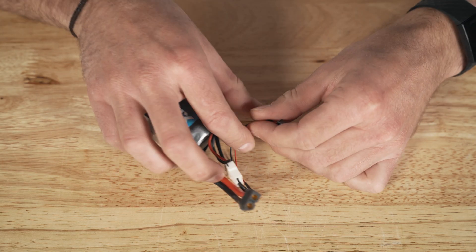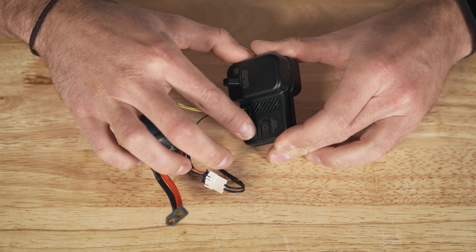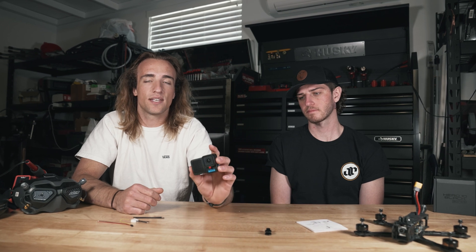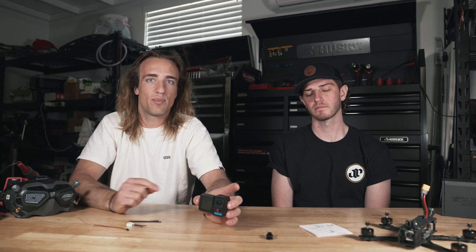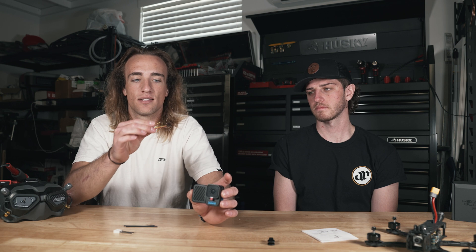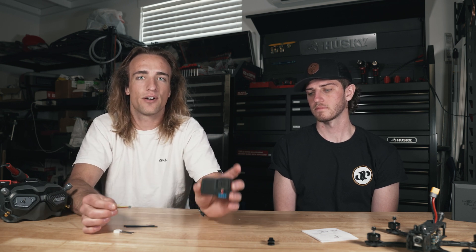Plug in to your camera and plug into your battery and your GoPro should power up so you can begin setting it up. The nice thing GoPro has done with these cameras is they allow you to run from 1S LiPos all the way up to 6S LiPos directly from the battery — you don't need anything placed between the power supply and the camera to protect it from high voltage. It's already built-in protected and ready to go.